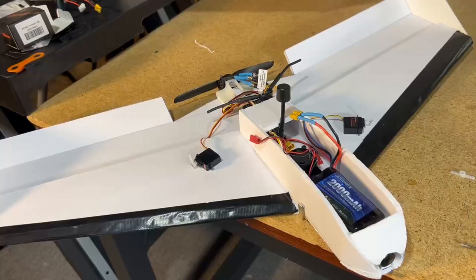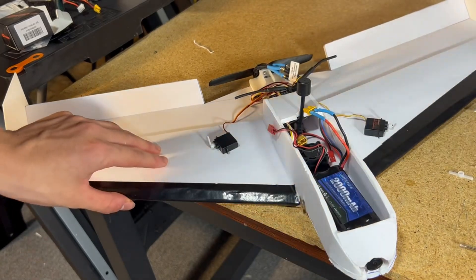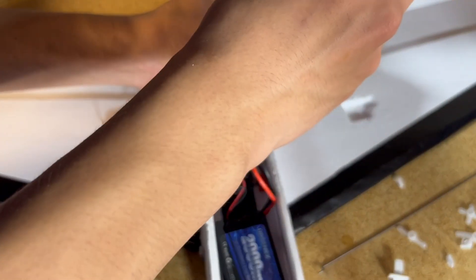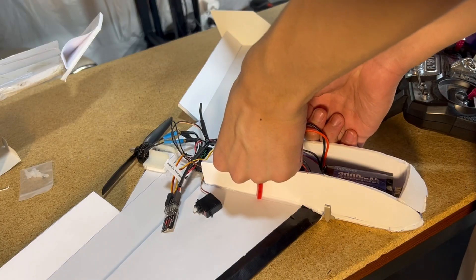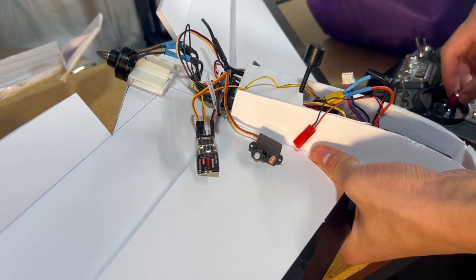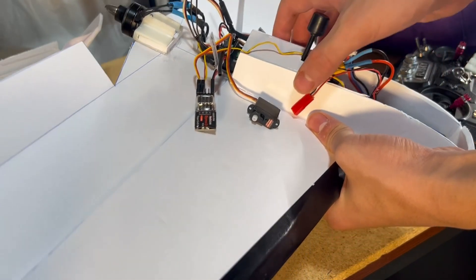Before I flew this, I tried using a lithium ion battery. These batteries are known for having a higher energy density than LiPos, which is why they are commonly used for long distance missions. My 2S lithium ion battery didn't end up working because combined with my 2300kV motor it didn't have enough power, so I decided I would just switch back to the 3S LiPo.